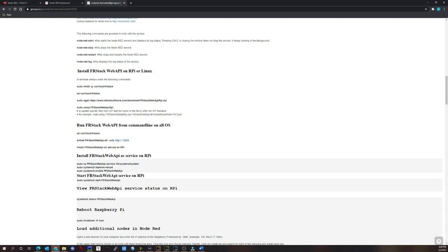We have one user using a Raspberry Pi with Node-RED for antenna switching, switching a four-square, and selecting different beverage antennas. Node-RED is gaining popularity with contest stations. Using Node-RED with an Elgato Stream Deck, a contest station can have a quick push-button keypad at the operating position to select different antennas, receive antennas, stack combinations, and other functions — all consolidated onto a single screen.